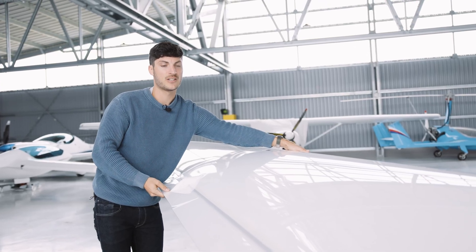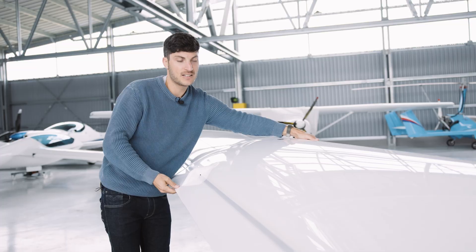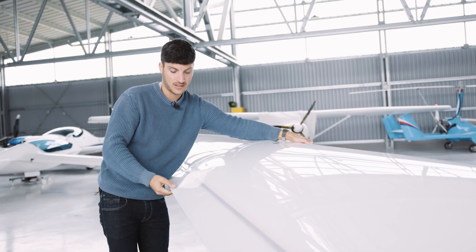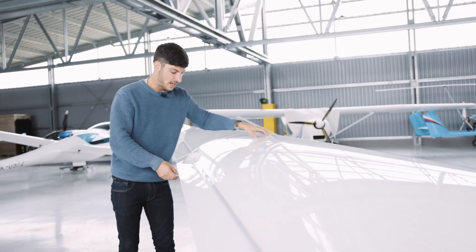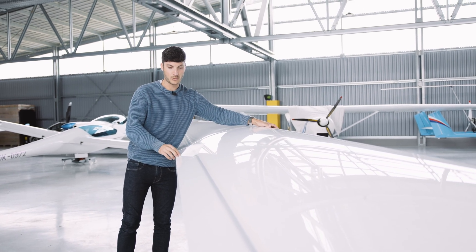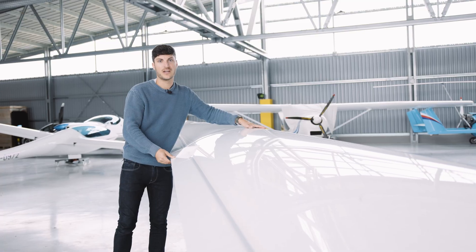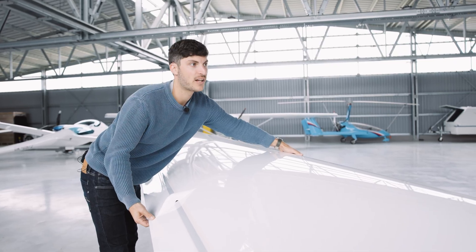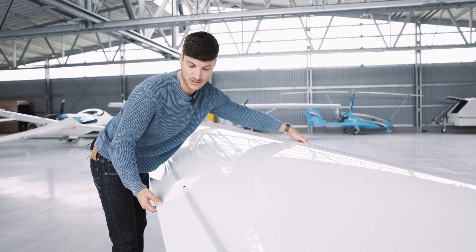We use a second person to make the test. Aileron to the left-hand side, aileron to the right-hand side, aileron neutral. Moving slightly — there you can feel the play. It's only a small play, that's normal and necessary. I prefer to use my hand at this linkage to avoid deforming the whole flap. Check the aileron flaps negative completely, then flaps positive. You can now move the aileron left and right — you can see they are also moving, confirming the mixer is also working.